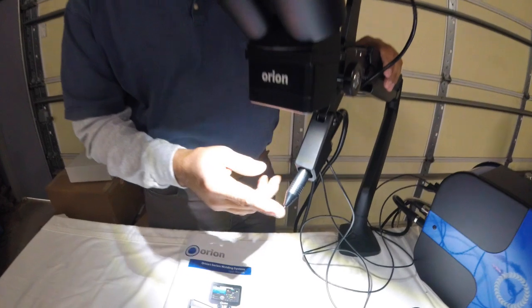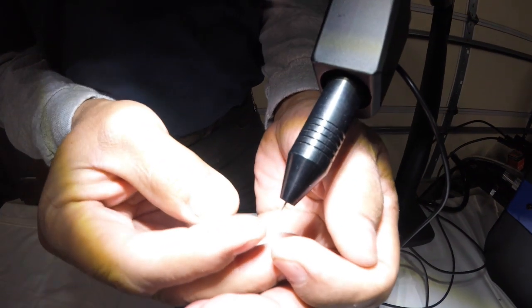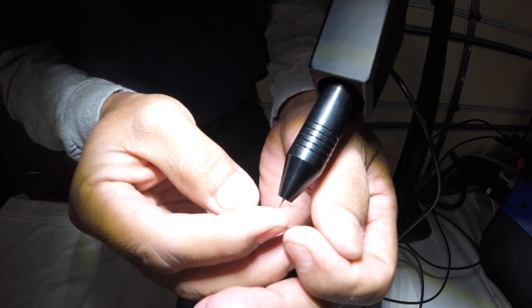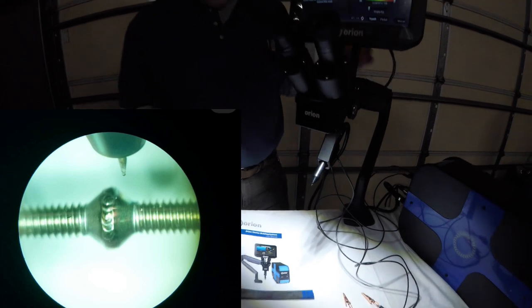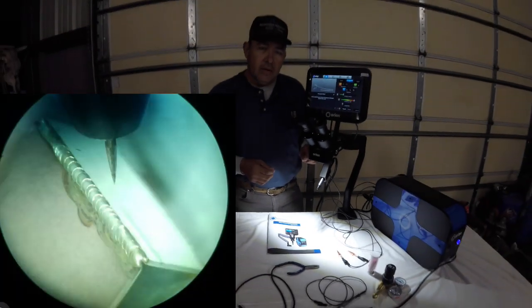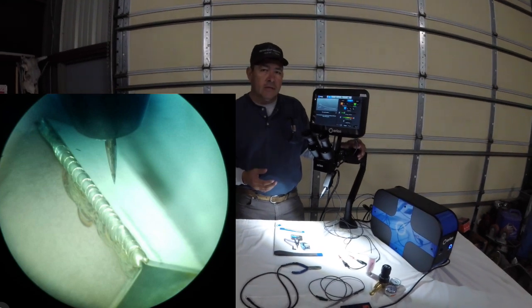This here is a nice little tungsten torch holder. Literally, you put up the two pieces with a little ground piece, and as you touch this, the tungsten will back off and create a spot weld. You can add filler metal, but it's more of a pulse, not a steady arc. Really neat technology in this machine.